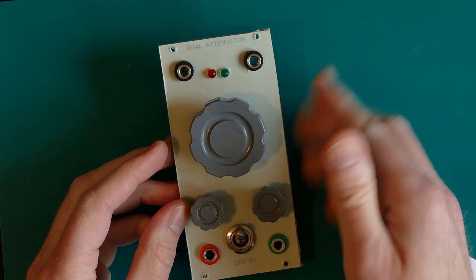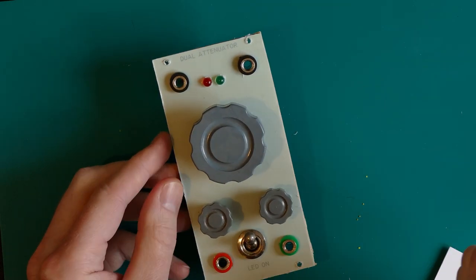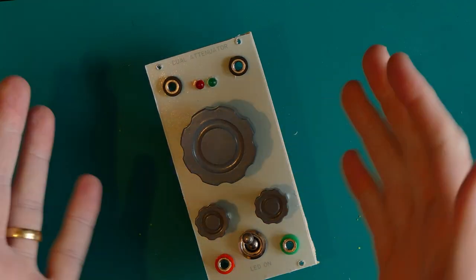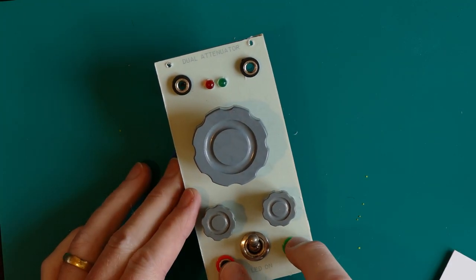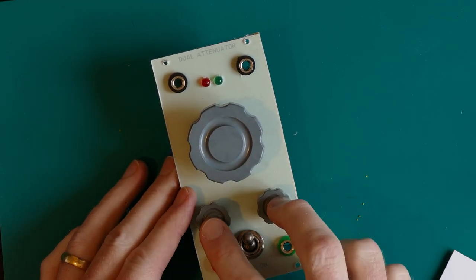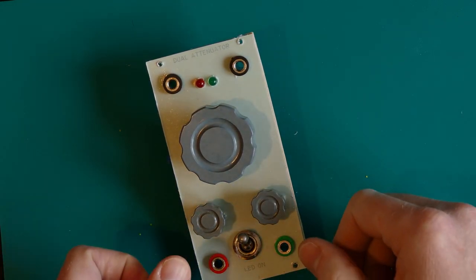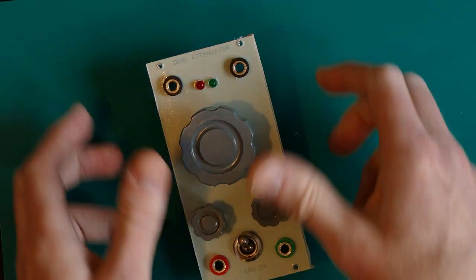I mean, I was really struggling when I was sawing this out because the plywood was flexing so much. And also I did make the mistake of sawing it out after I put on the components. The thing is, I was doing the drilling, and basically cutting is meant to come after drilling, but when I was doing the drilling, I also had to test fit the components, and then I had to drill it out even more, and then I had to put them on again, and then I just kept them on because I was so preoccupied with making them fit.